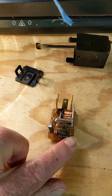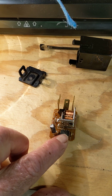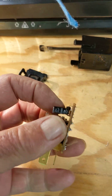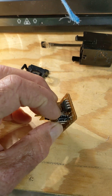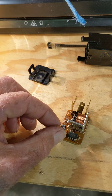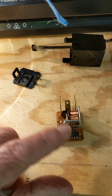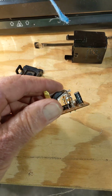Since it works intermittently, I doubt it's the chip — chips either work or don't. The resistors will burn up or not. But this capacitor, being an electrolytic capacitor, over time the chemicals inside can dry up or change value. It's an energy storage piece that stores voltage and kicks it back again. In an oscillator circuit that's a critical component, and changing its value can set the oscillation faster, slower, or cause intermittent behavior.